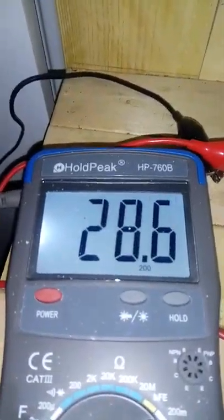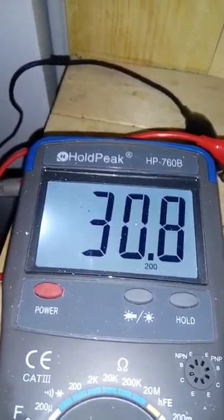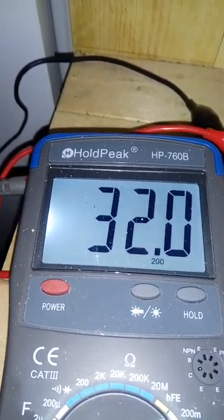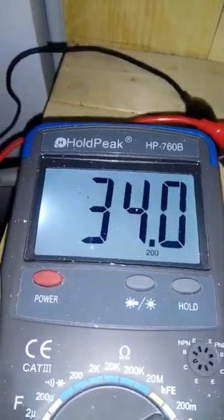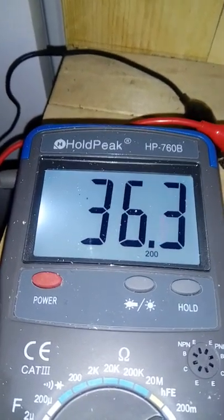We are already up to 20 millivolts, which is what I need to do some real heat sink testing. We are much over the 20 millivolts needed — the nominal threshold for the thermoelectric harvester to function correctly. So we are way over that voltage now.